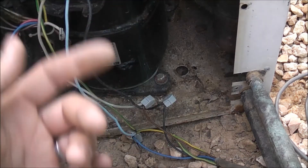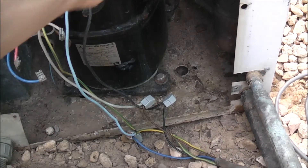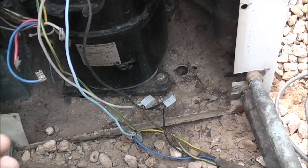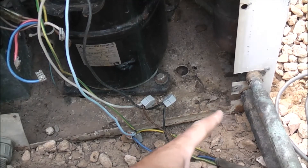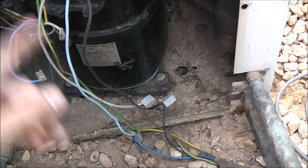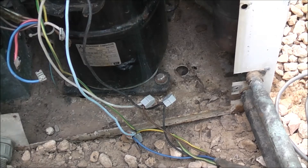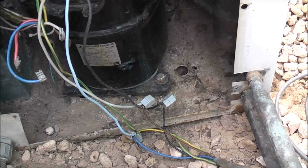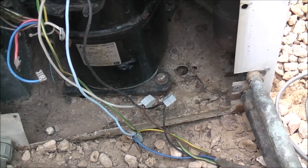The same way you take the indoor unit out — you shut off the high pressure side valve and let the compressor suck everything and evacuate the indoor unit. Then you disconnect it and shut both valves, shut the suction valve, then turn the compressor off, the outdoor unit off. That's as much of the refrigerant you can get trapped inside the outdoor unit as possible to save. The less you lose the better — when you recommission it, you won't have to top the refrigerant up.